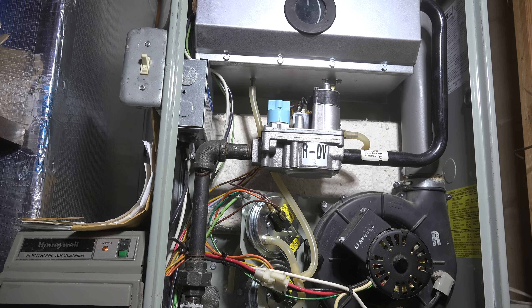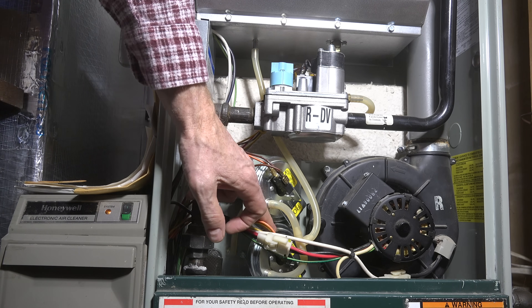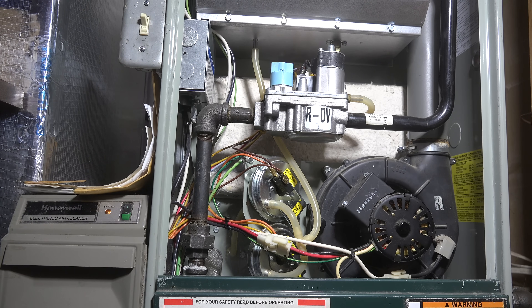Let's assume we've done that and it went back to the pressure switch code. Now this one's got two pressure switches right there because it's two-stage. What do I do — replace these? First, chances are I'm not going to replace those things. They are pressure switches that sense something is wrong — it's not ready for the burner to light, there's something unsafe. So the last thing I'm going to do is replace the pressure switches.